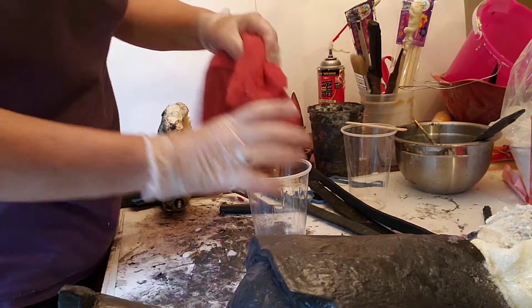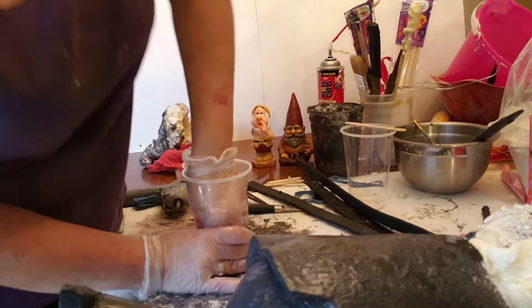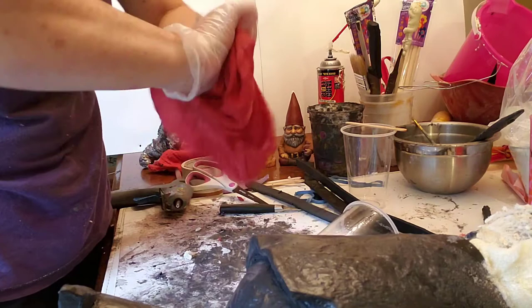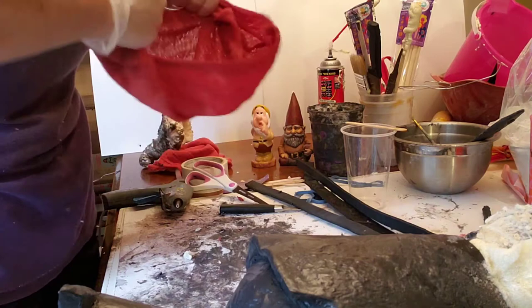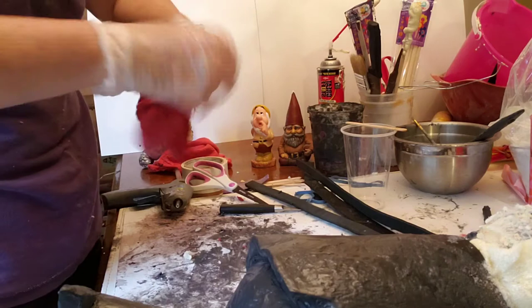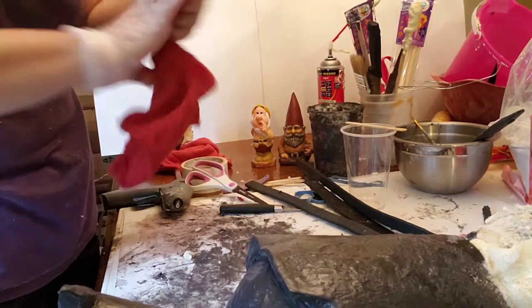My little workstation here is a mess, but it's what you get when you play with epoxy. Just dip it all in, twist it around, try to soak up all the material. What I do is open it up and wring it, bringing all the epoxy into the dry material. Just keep working it, working it — you feel it getting warm, definitely want to wear gloves. You can feel the heat activating in your hand. This goes fast — see, there's some dry areas still, so we just work that in.